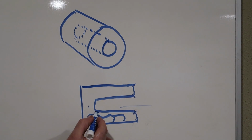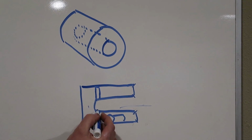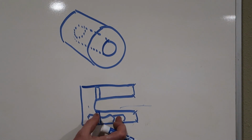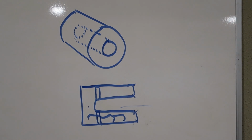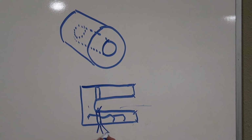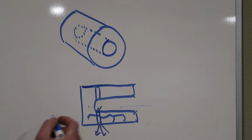So I want to come in here and add some sort of almost like a fin to the edges of the inner chamber. So just in case these sponges break down over time, there's some sort of a rear support to the chamber. And this will be a thermal loss because we are kind of violating our insulation right there, but I think it's worth it. And it'll make the whole unit stronger. So that's the next step, is to add these little tabs before we start assembling.